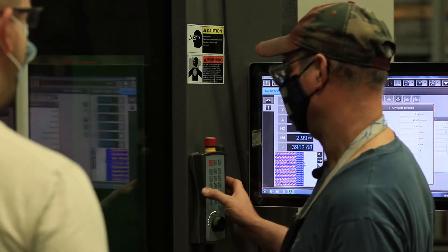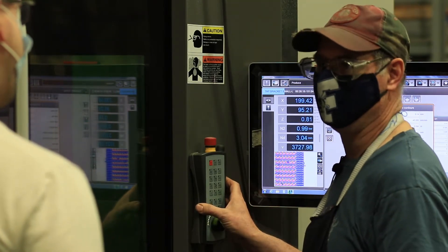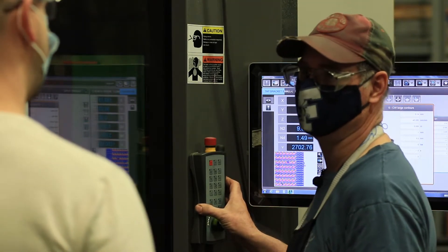And is this part 20 gauge? Yeah, 20 gauge stainless steel. And how thick can you cut up to? About an inch and an eighth on stainless steel — so that would be my maximum. And can you cut most metals with this?